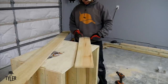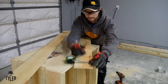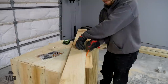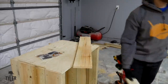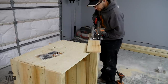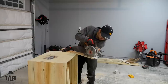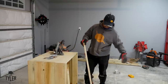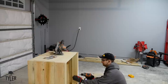We need two small pieces to cover the 2x4 on either side of the door — this will give us a flush point to mount the hinges and the lock. Most days I would throw this on the table saw and cut it to the perfect dimension, but we only have a circular saw today. My straight fence board allows me to strike a line, and then I'm repositioning the board as I cut so that I don't cut through my tabletop, which happens to be the house. This way you can keep your hand out of the way and cut thinner pieces to cover that front 2x4.